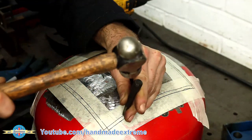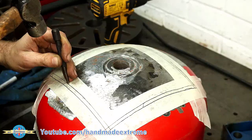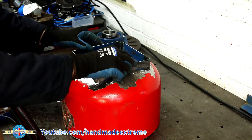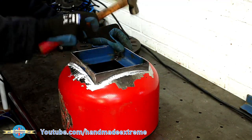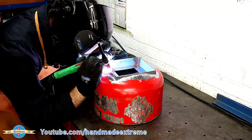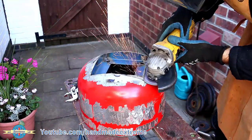I then went around with a center punch and made a little line of dots so that if I burn the piece of paper when cutting I can still find the line. Took it outside and chopped it out with the plasma cutter — in hindsight I think I should have probably just done this with the grinder and a slitting disc, but you live and learn. There's our cutout and the box is a nice snug fit in there. Just give it a little tap down with a hammer to get it all nicely snugged away, get all the high spots flush, then just a little stitch along each of the centers. I could then cut the corners off with the slitting disc just to get a nice flush finish to match the top of the tank.